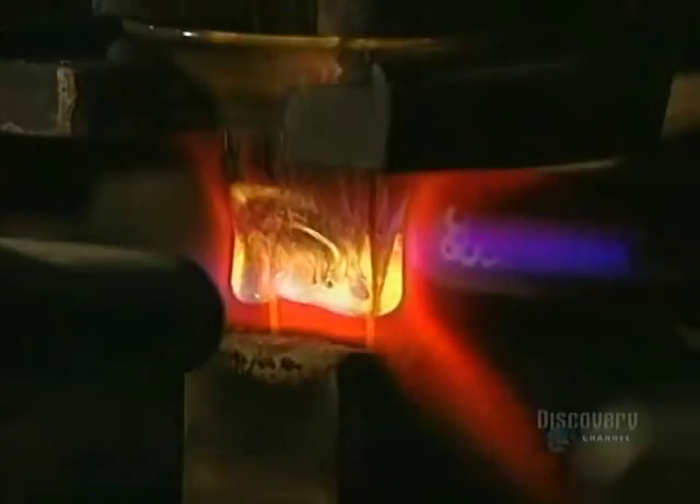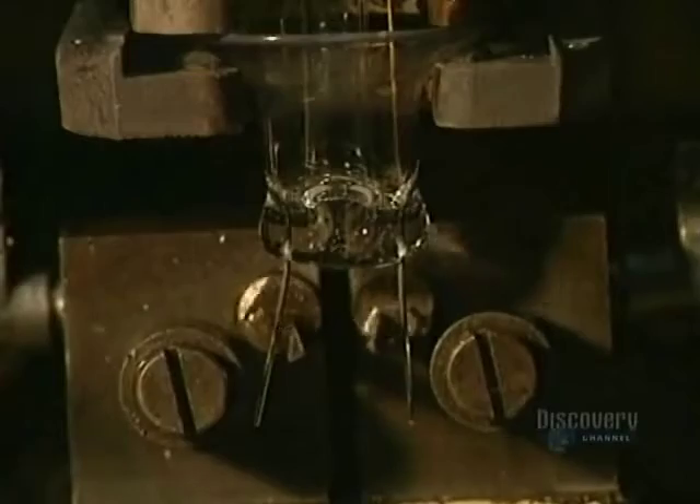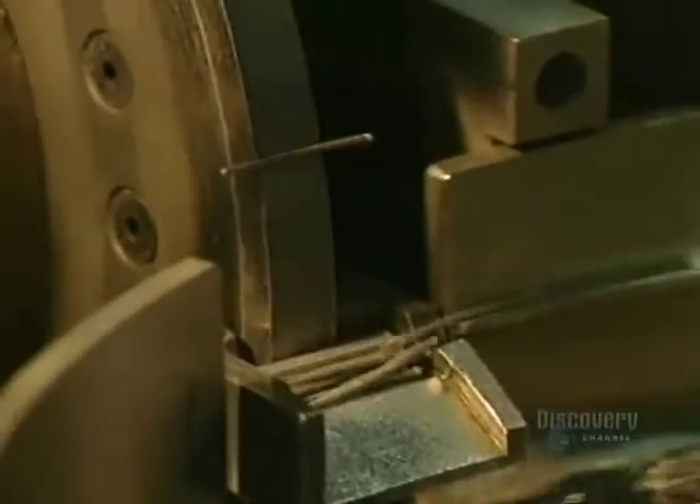They now move to the electrical components. The cathode mount is made in this automount. Here they make the wire carrying current from the mount. The wire carrying the current is shaped, and then the wire is heated. This prepares it for the next step, because it's essential to prevent the cathode coating from spreading to the prongs.